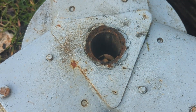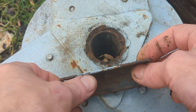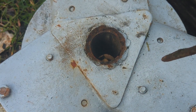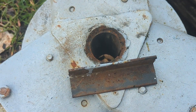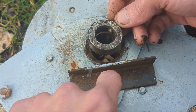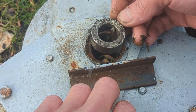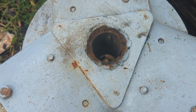The problem is because it's cast iron, the welding's hit and miss to say the best. So what I've decided I'm going to have to do is get three bits of metal similar to this but shorter, and then bolt them just there. I'll bolt each bit there, line it up perfectly to the outside of the collar, and then weld those three bits on to the collar. If I can bolt through here then that's no problem — I can even bolt through there and make a triangle. But that's the fix I've got for that.